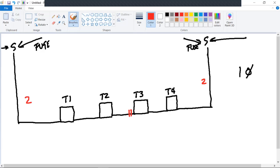Now, this is what kind of confuses students sometimes. If I'm going left to right down my dip pole in this direction, and I'll draw the transformer down here again, just to emphasize, which side do I go in on? Left. In A and out B. That's pretty simplistic. In A, out B. In A, out B. When you're coming from right to left, it crosses. In A, out B. See that symbol I made right there?